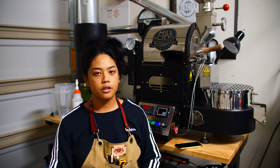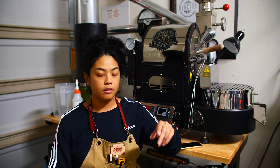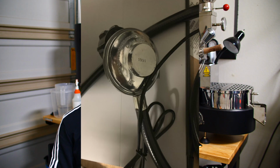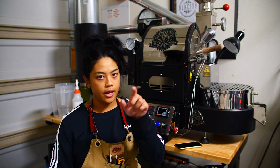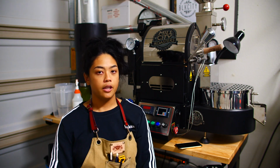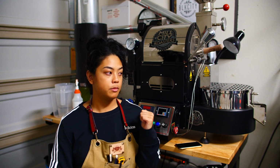And you'll need something similar to a barbecue, which is a propane gas regulator. You need it to regulate at 1/2 psi. 1/2 psi. Nothing greater than that. The one that I first purchased, I went to Amazon and bought a regulator, and it was at 50 psi. So it was blowing a lot of gas into this machine, and I didn't find out until later that that was bad. So you need a 1/2 psi regulator so you don't blow out your machine.